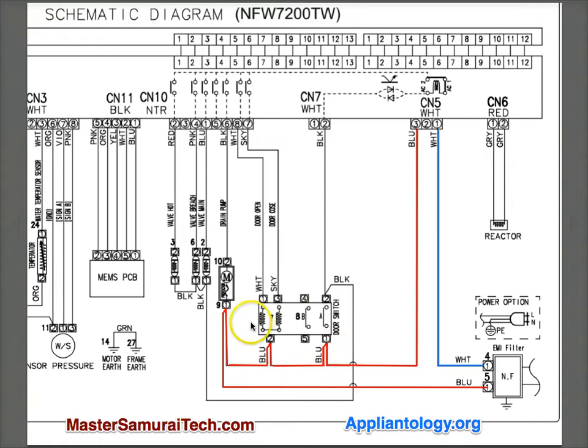Now let's look at this door lock assembly. These coils are loads. For a 120-volt AC load, it's going to require line and neutral in order to operate. So even though they don't tell me here explicitly what's going on, if I'm getting line on one side, I've got to get neutral on the other side in order for this load to function. Solenoid coils are loads, and we can draw that in - and we can always reverse this later to show the analysis works either way.